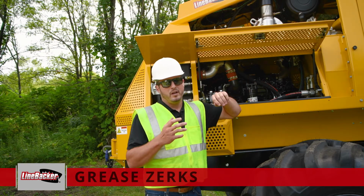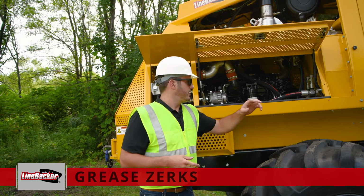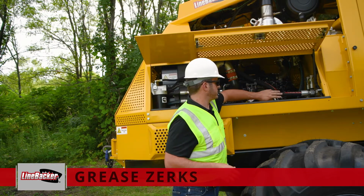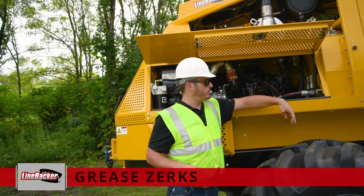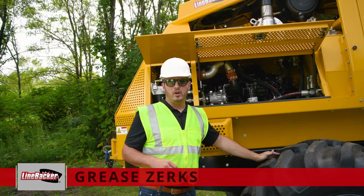Earlier we spoke about the grease zerks for the rear of the steering cylinder. Now those are located just underneath this hose. There's 4 grease zerks. 2 of them are for the steering cylinder and the other 2 are for the axle trunnion.